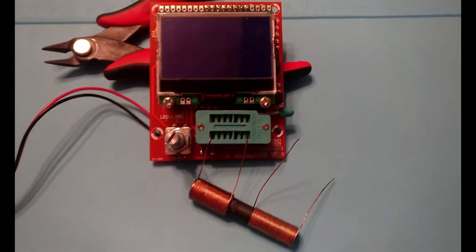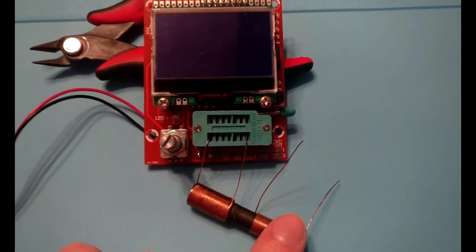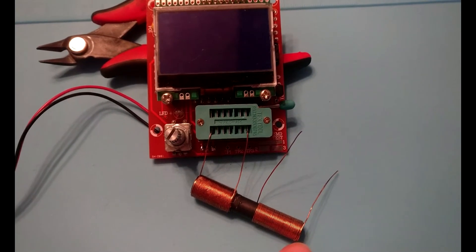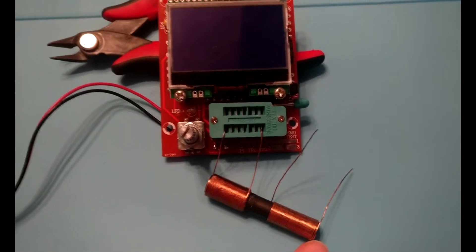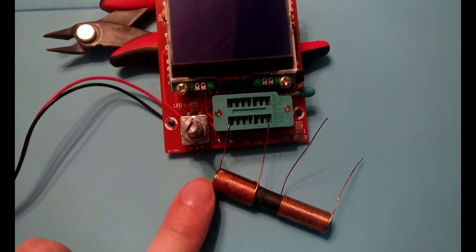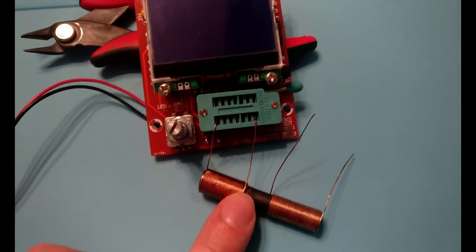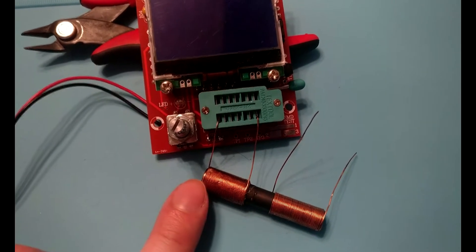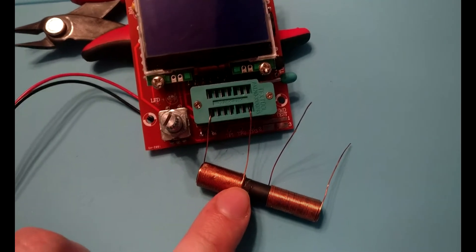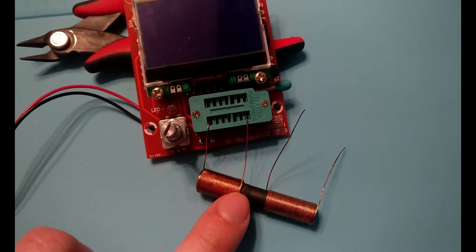Alright, we're back. I'd taken down all my camera stuff, so pardon the slightly shaky camera. I finally got the coil wound — this was actually quite a project. What I did was I started by super gluing one turn onto the end of the coil, then wound 43 turns on for the primary. For the secondary, which needed 120 turns, I didn't have enough room to do 120 turns neatly, so I super glued one turn, did 41 turns out, then 40 turns back, then 39 turns back again for a total of 120 turns.